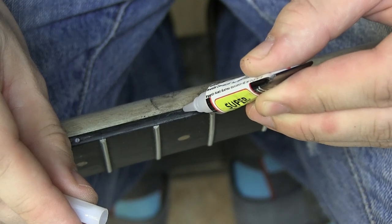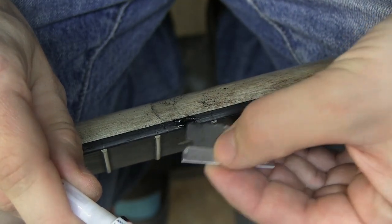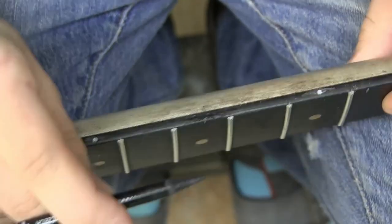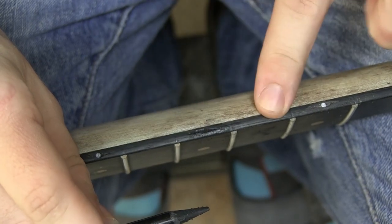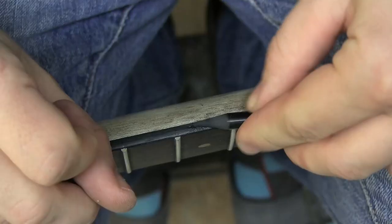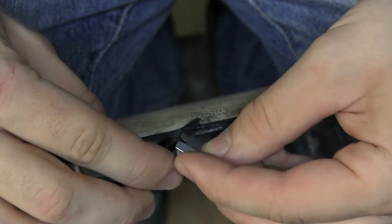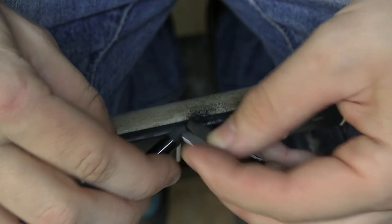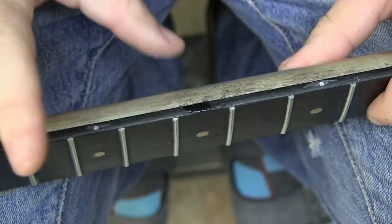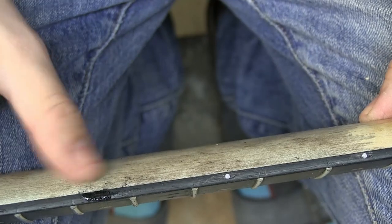And then I'm just taking some super glue. And I'm just going to put a couple of drops there. Move it around with my razor blade so that it doesn't go everywhere, because I only want it where I want it. And it might look a little bit sloppy and weird right now, but don't worry, we can clean this up. And so, hopefully you can see it's starting to disappear. It's not really gone yet, but we just keep on adding more and more black powder until we basically plug up the hole. And if we go a little bit over so we have a bump of super glue and color pigment, we can level it afterwards. So I'm just going to leave it like that. It sticks up a little bit, but I'm going to have to wait a couple of seconds for it to dry, and then I'm going to do the next holes, and once I've filled all of them, we'll come back to it and level it, and I'll show you what it looks like.